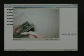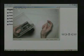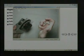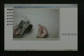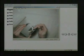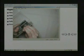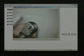On this safe over here, this is just a fire-rated safe. It's not burglary, meaning that as I was spinning it, the whole lock was just jamming against a really large difference in one of the wheels, which was giving me a very obvious indication of what the number was. Okay, I got this again. You can see that the nose now, because all the gates are lined up, the fence is able to go down, and the nose enters the cam here and retracts the bolt.